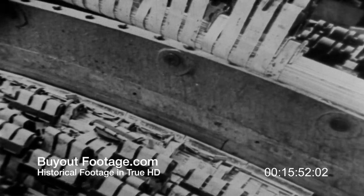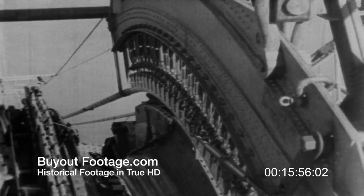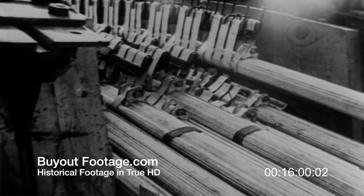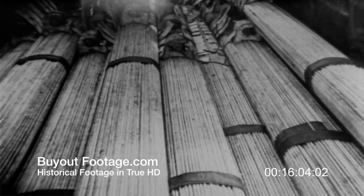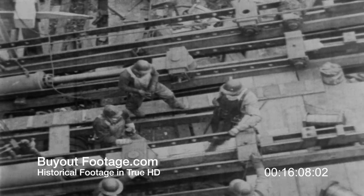These bands are to remain in the cable saddle, so their thickness is restricted to five one-hundredths of an inch. On this account, and because only a limited number of bands could be placed along the beam, and because the results of a failure of this wire would be so disastrous, one of the strongest flat wires of the many made by Roebling had to be selected for this purpose.